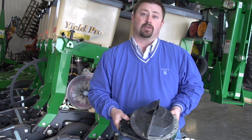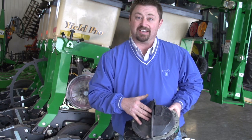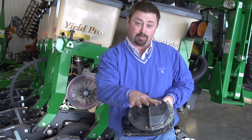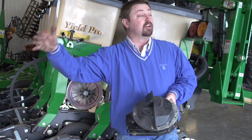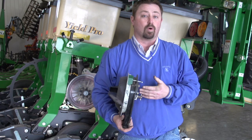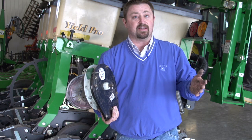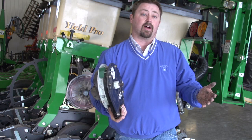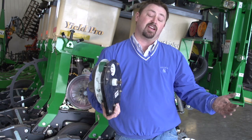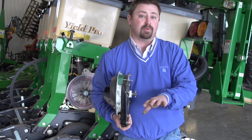Here's the other thing to do. Take your typical planting speed that you'd run and let's look at the largest seed that you have and see how the singulation is affected. Again, normal planting speed, 2 miles an hour faster, 2 miles an hour slower, okay? Take various size seeds and run that with your seed meter professional and just get an idea of what's gonna happen singulation wise if you speed up your planter or slow it down. It'll also give you a pretty good indication on air planters where your pressure settings need to be as well.